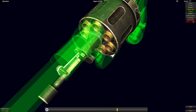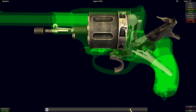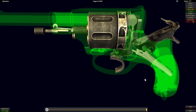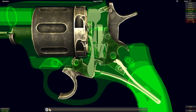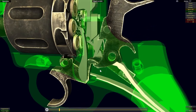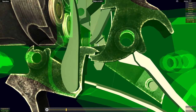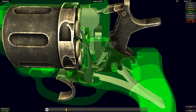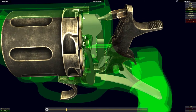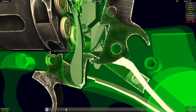You're also going to see the cylinder come forward as we get to the end of cocking the hammer, and that's part of the gas seal mechanism. As we've seen, when the hammer gets cocked back, it comes up underneath the trigger and pulls up on it, and the trigger eventually contacts this part here via this surface. I don't know the official names for these two parts, so I'm going to name them myself. This part I'll call the pusher, because it's responsible for pushing the cylinder forward, and this part I'll call the slider, because it slides up and down.